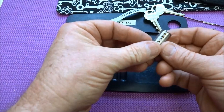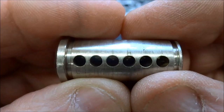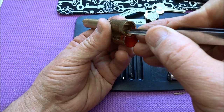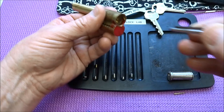I'm going to make the key out without dropping anything. Didn't feel like any security pins. Let's turn this around and do it in sequence. OK, that was the easy part — no security pins there. Nothing unusual about this core. Jeff didn't counter-mill it or thread it or anything like that. Here comes the fun part — this part always makes me nervous on these LFICs. If you don't get the pins in order it becomes a nightmare to put back together. Pin 1 is not going to be an issue because it doesn't have that core; it's a standard pin. Pin 2 becomes part of the removable core, so I need to get them in sequence.